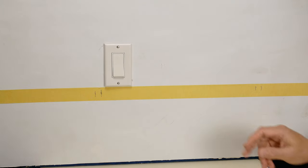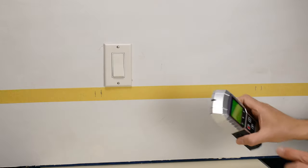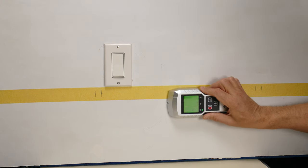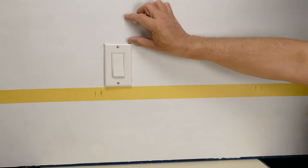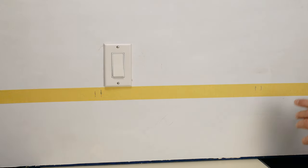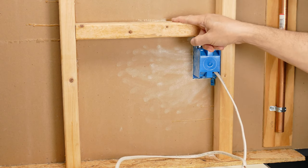We have to be careful whether there is a fire block in the wall. I know this one has a fire block — it's at the higher end here, and I can check that with the stud finder as well. There's the fire block right there, right above this switch. I'm not going to go higher than that, so it's just good to know there's a fire block about here. If we take a look at the back you'll see — the fire block is right where I thought it was.